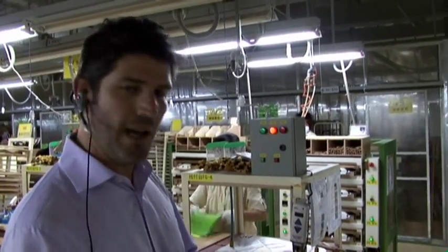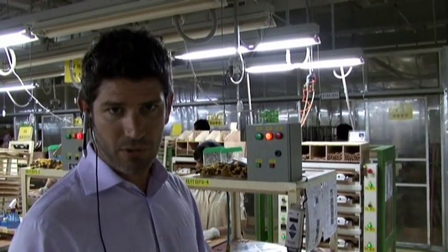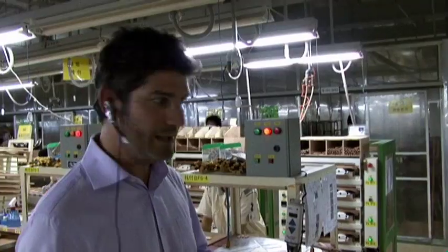So we're over here now, and we're going to look at actually bracing the guitar top. Bracing with the sound bar is one of the most important parts of making a guitar because it does 2 things. It affects the sound quality of the top of the guitar, and it also allows it to have structural integrity so it doesn't crack and break.